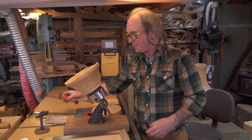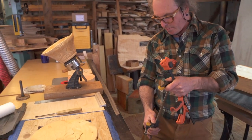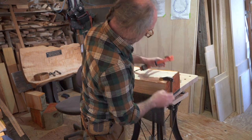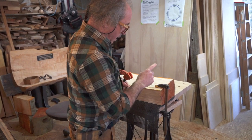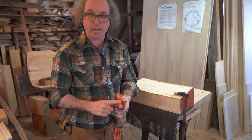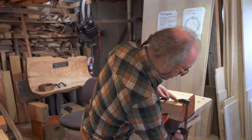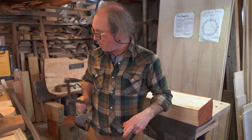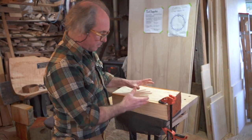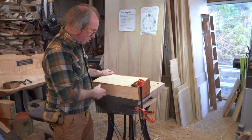Now, the simplest way is with a clamp. That's a really standard clamp. It's called a bar clamp. It's very versatile in how big it is, how deep it is, and you can basically just clamp to whatever solid work surface you have. A couple clamps holds that good. I would recommend, however, switching to a clamp like this. These little speed clamps don't have the same holding power, but the advantage for carving is that this is plastic. If you accidentally hit this with your knife, you haven't ruined your day. You maybe dulled your knife, but you're not going to destroy your knife, which you could on a metal clamp. So that's number one, just having a couple clamps. It's the easiest way to hold something for carving. And that way you don't need your body or your exposed hand to be holding the work. It's held for you.